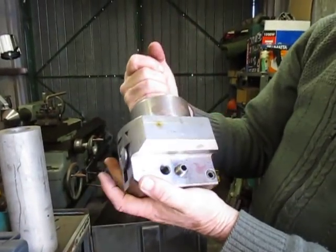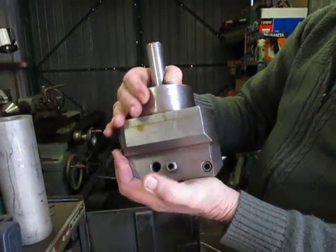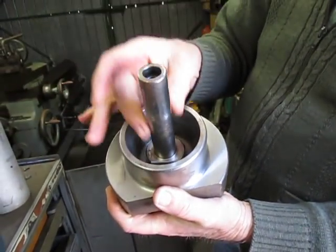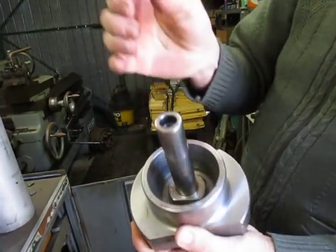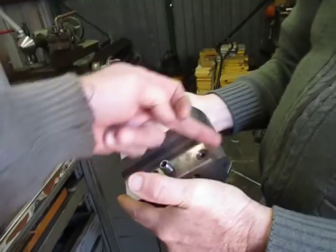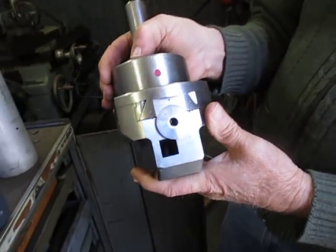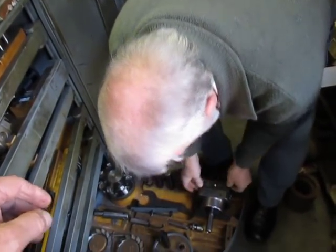Sometimes you might have the requirement of doing quite a large facing or centering job. It has a taper section in there and this is parallel — that just fits up into the quill. The draw bar goes in and is pulled up on this taper here to give it rigidity on this large one. And like the other tooling, it's micro-adjustable. They're not straight through — they all go through at an angle to give them their clearance, which is quite good because that gives it clearance below the actual head itself when you're machining.